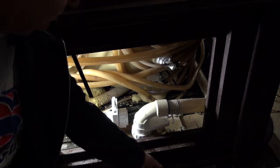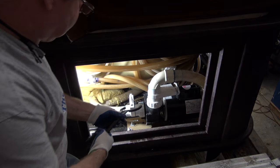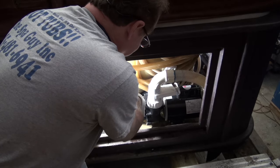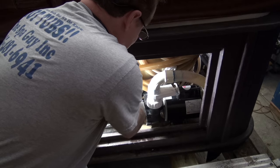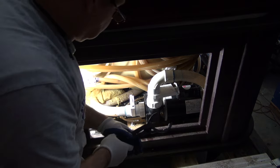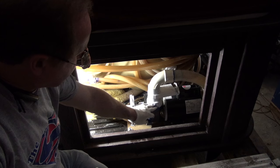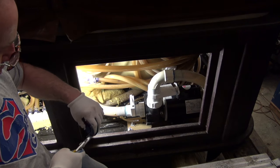For a tutorial on that, look for waterway pumps and I have plenty of information on that. I worked on that other pump and could not fix it — it was too damaged. The bearing was completely locked up and the shaft was destroyed. So I had this other pump. This is actually a different brand. The other one was a Waterway Executive; this is an XP2E AquaFlow. Similar specs, but the one difference is the placement — the Waterway is a hair higher and a hair further out. But since this is all flexible pipe, I was able to use it in place of it.